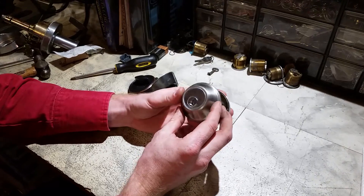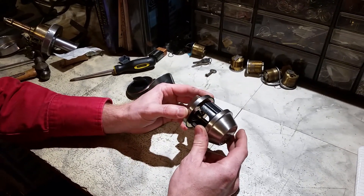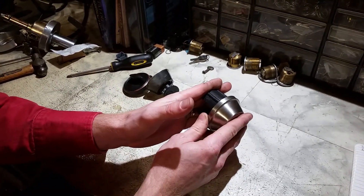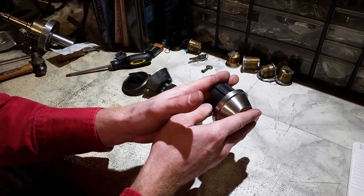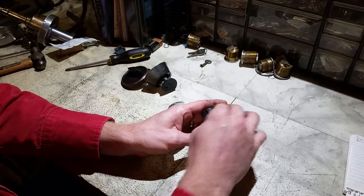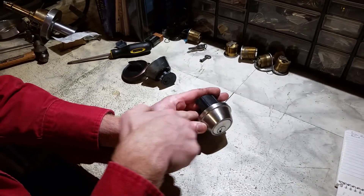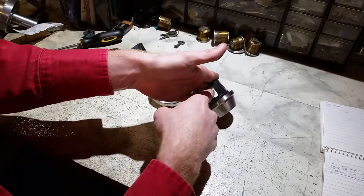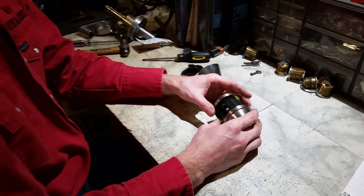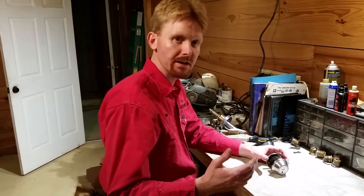This, however, is a Grade 2, heavy duty, commercial duty deadbolt. As you can see, this shroud goes into the door, so when it's tightened into place, the shroud prevents movement out of the hole. Furthermore, it provides protection from access to the latch itself, which is going to be through the center of this shroud. So you can pound on this, and eventually, with a large enough hammer, enough time, and enough noise, you could break this.